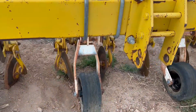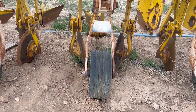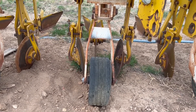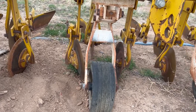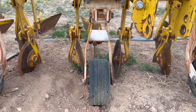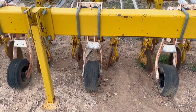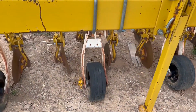If we look down — we'll just kneel down right here so you guys can see this — you can see we've got a guide tire slash gauge tire here in the front. Then you've got your cutter discs right behind that, where you would peel the weeds away. Follow that up with a guide disc right behind, and then you've got your shovels in the back. There are no shovels on the markers, but he's going to put them on — he took them off and put them on his regular marker bar — so we will get those shovels back on and update the pictures accordingly.